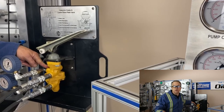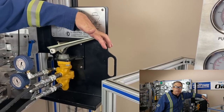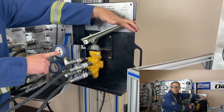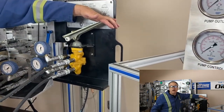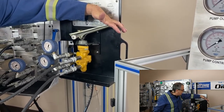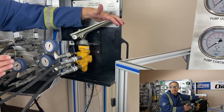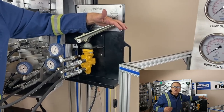What you probably just noticed when I had the hydraulic system running is that as I leaned on the brake pedal — the harder I leaned — the more the pressure came up on the two outlets. The two outlets would be for the front brakes and another outlet for the back brakes. There are actually two separate valves in there, and while they're tensioned together by one action from the operator's foot, they're actually separate valves so they can maintain just the right brake pressure separately for the front and back brakes.